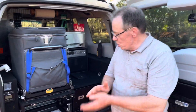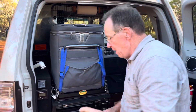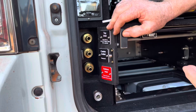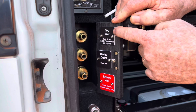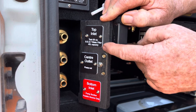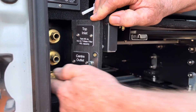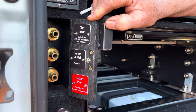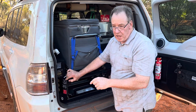We just showed you the water tank, and the next obvious question is how do you fill it up. There's a system here with some inlets that take standard hose fittings — the same brass fittings you can get at Bunnings. The top inlet is how you fill the tank normally, because it goes through the BEST water filter. The centre outlet can be set via valves to pump water out, and the bottom outlet can be set to suck in — so if you have a bucket of water or buy 20 litres from the IGA on a trip, you can pump it through the bacteria eliminating filter.